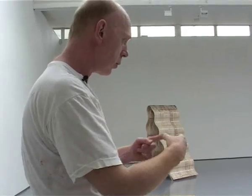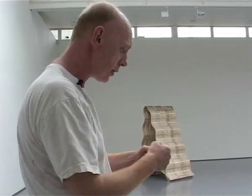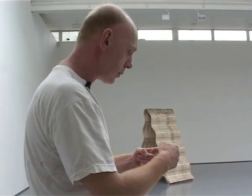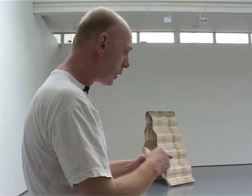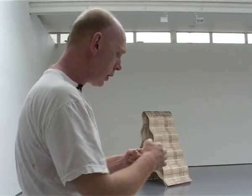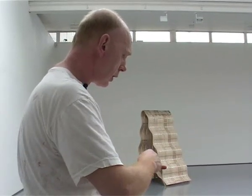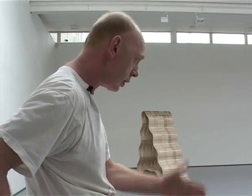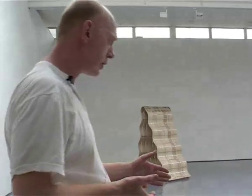But bending the wood, you need to keep the length the same, so as you bend it around, you can't let it stretch on the outside of the curve. If you do that, it starts to crack and split. So the steaming adds water, and then the bending pushes it out like a sponge. And in order to keep the length constant, when the pieces come out of the steamer, they're straight away put into a holder with an end stop, which has a metal strip, which is used to bend it against the former.